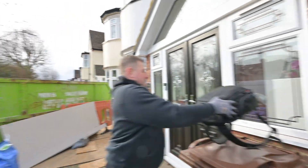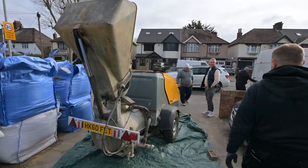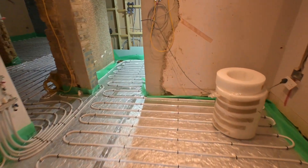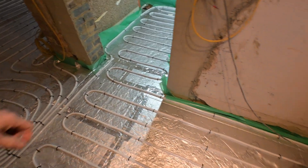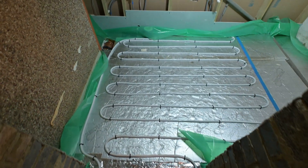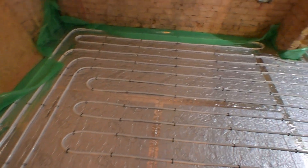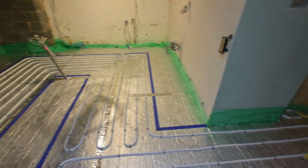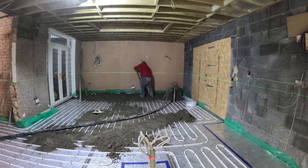It's time for the final step of the floor layout — the screeding. The KP screed team is here setting up their gear. We've used the same company for two years now. The underfloor heating is all done nicely, and there's the expansion foam that goes between the wall and the screed. This is a very important step because once the screeding is done we can work on all the plasterboards on the walls and start really finishing the job. All the wiring and plumbing is done — we're going downhill from here.